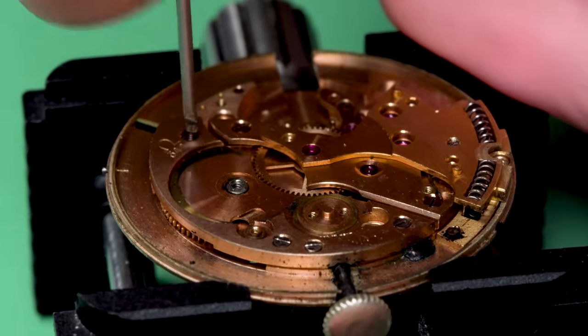Now we can put the barrel arbor in with a tiny bit of oil on the top just because it interacts with the lid there and I want to make sure it can spin freely. Now we can start the reconstruction of the actual movement itself. First we'll start with the train of wheels — this is the escape wheel going into place. This looks like the fourth wheel because it has that extended pivot. There's a long pivot on the bottom of this wheel that sticks out the other side of the movement all the way through and out the other side of the dial — that's actually what you put the seconds hand on, because that wheel happens to go around once every minute. So if you put a seconds hand on it with 60 seconds around it, you've got yourself a seconds hand.